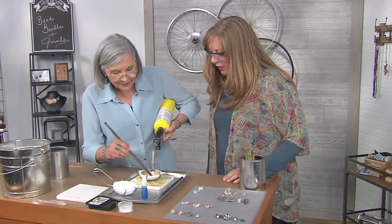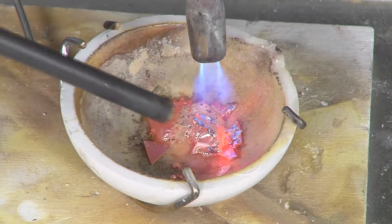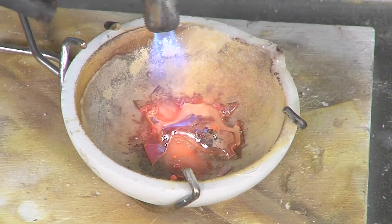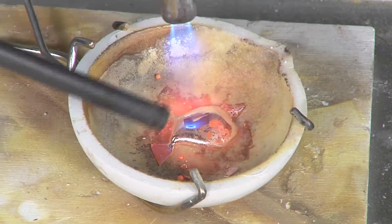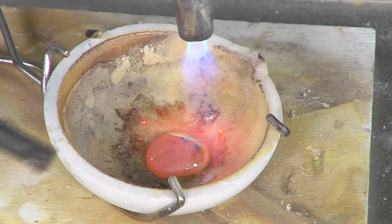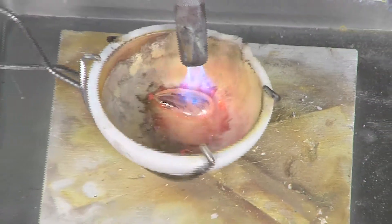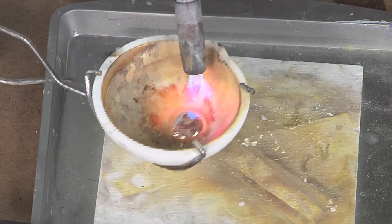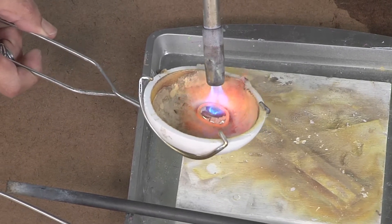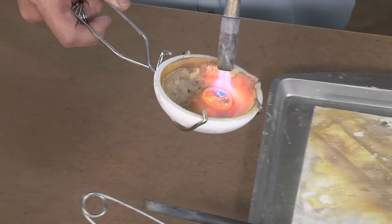Part of it is starting to turn into a mass and I'm just helping to consolidate. You don't want to use the graphite rod too much because it does act as a heat sink and will cause the silver to take longer to melt. It's getting close — you can see it's still orange — but we want it to look like mercury. I'm rolling it around so I can see if any part of the silver is still hard, because sometimes you get it melted on the outside but not quite on the inside, so you've got to keep the heat on it.